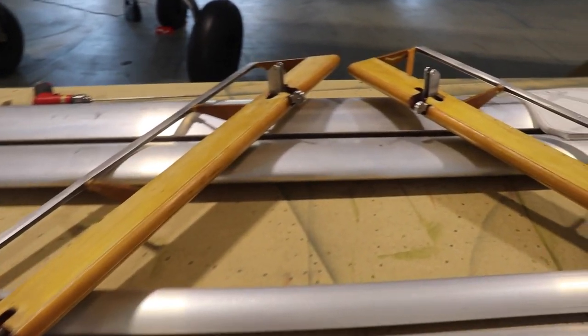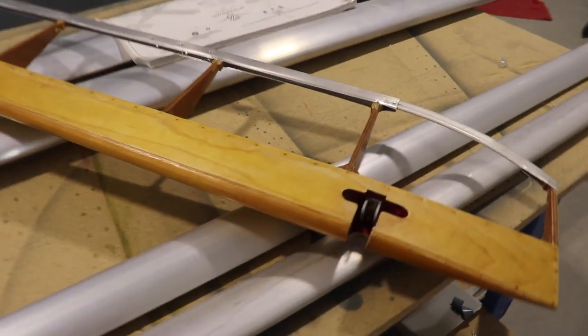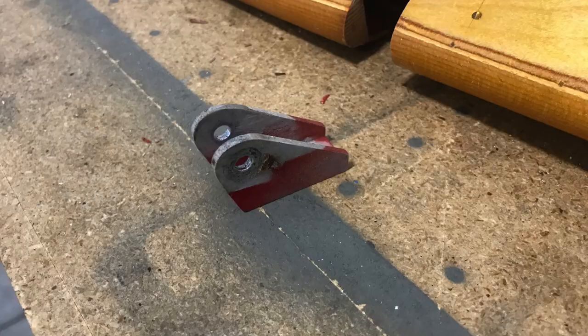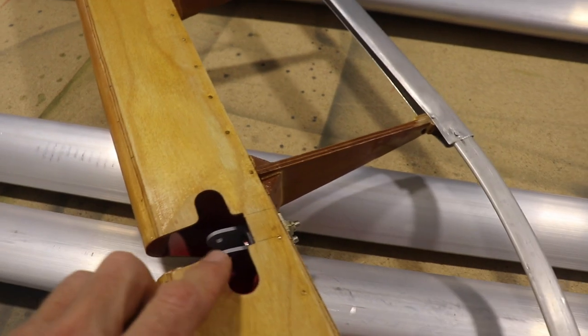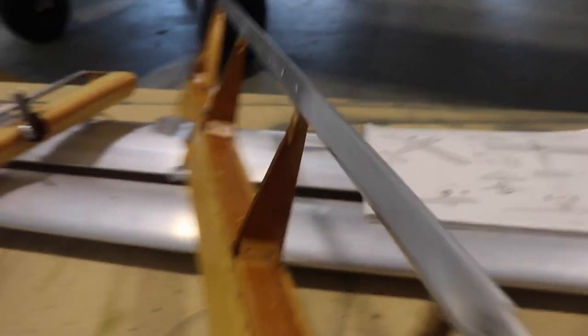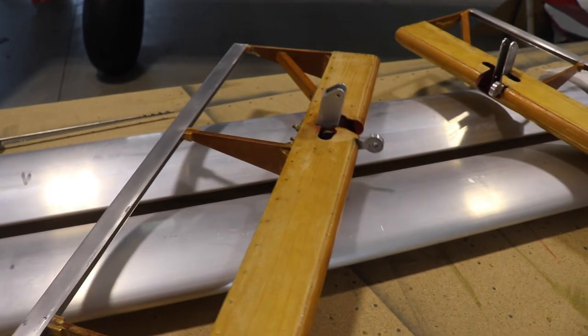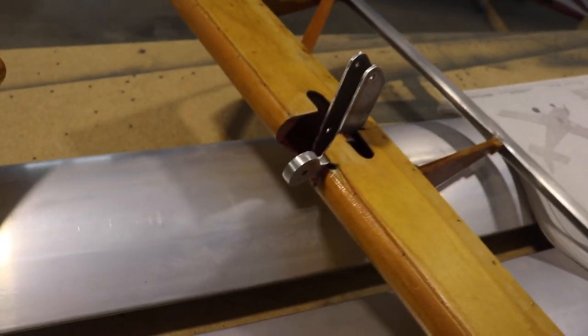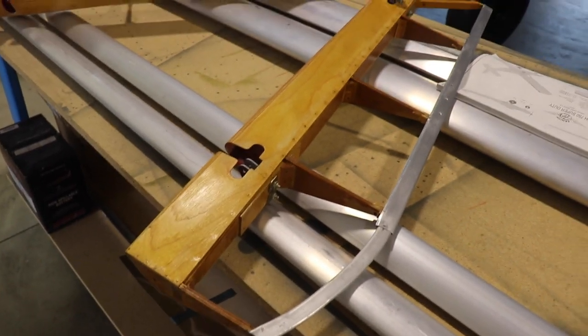The first thing I did — probably the easiest — was to remove the two lower ailerons. I stripped the fabric off, and parts like this little bracket right here I took off, cleaned up, reprimed, and reinstalled. I cleaned up the wood a little bit, made a nicer cut than what they had. Everything is in really good shape — the ailerons are just perfect. Both of them are now ready for fabric covering. I polished them up a bit; they'll get painted again, but I took off about 30 years of gunk that had built up on them.